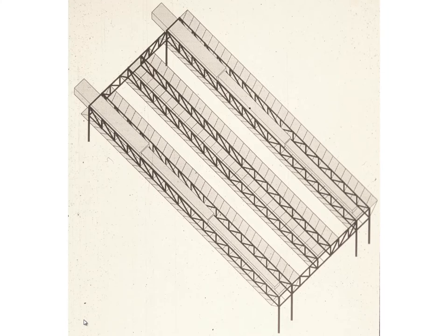It's not what we would do if designing a structure from scratch, particularly if we want to provide any kind of fireproofing for the roof structure. As an alternative, we could move some truss joists closer together, produce a larger gap on the other side, and contain pairs of truss joists inside a sloped ceiling. The slot represents where the roof monitor or daylight aperture goes, and the encasing material — such as sheetrock — could be fireproofed to protect the structure.